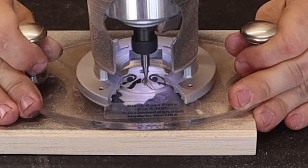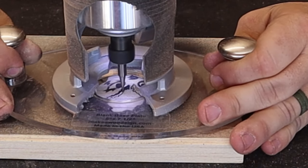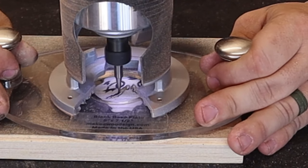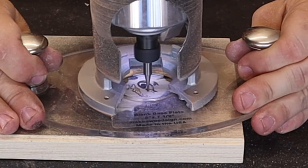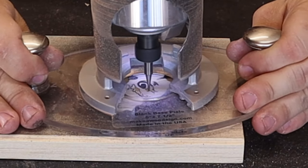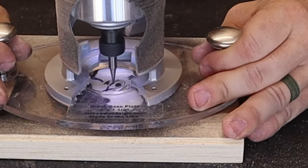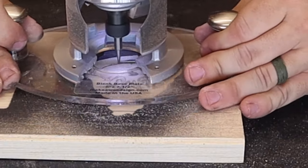The first bit I'm using is our carving liner at an eighth of an inch deep. Now this thing is perfect for doing this Grinch smile template. You might be able to get away with using the profile bit, but the carving liner is really the way to go. Now one thing to remember is that when we make templates, we have to add some lines. Think of like military stenciling. You can leave the lines or you can carve through them.